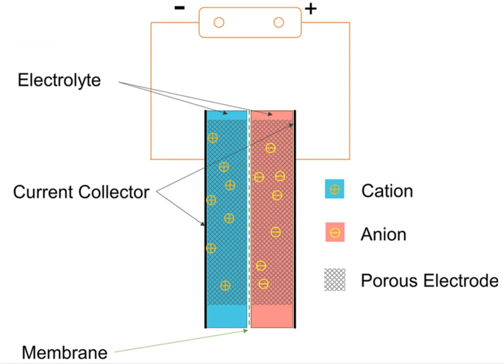Specific power is measured either gravimetrically in kilowatts per kilogram (kW/kg, specific power), or volumetrically in kilowatts per liter (kW/L, power density). The described maximum power P_max specifies the power of a theoretical rectangular single maximum current peak of a given voltage. In real circuits the current peak is not rectangular and the voltage is smaller, caused by the voltage drop.